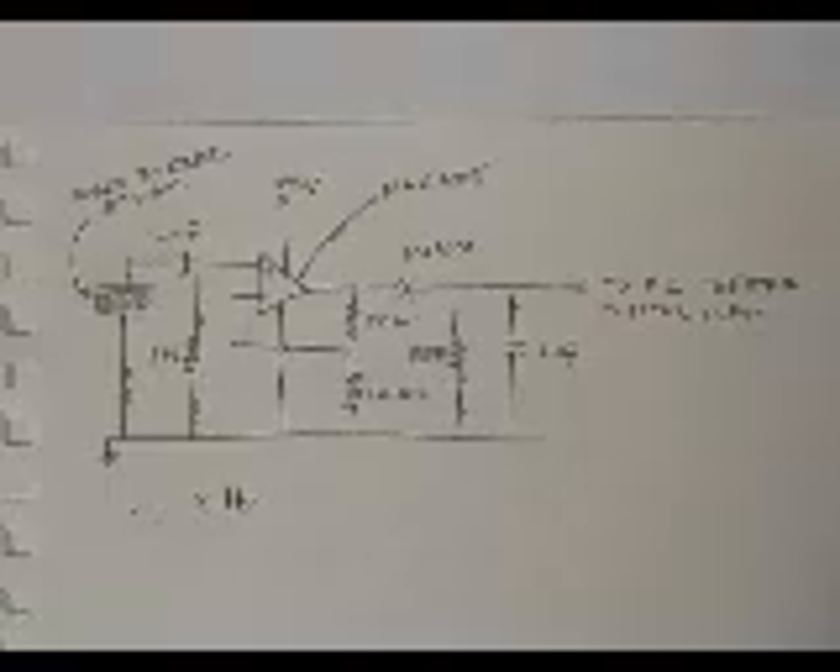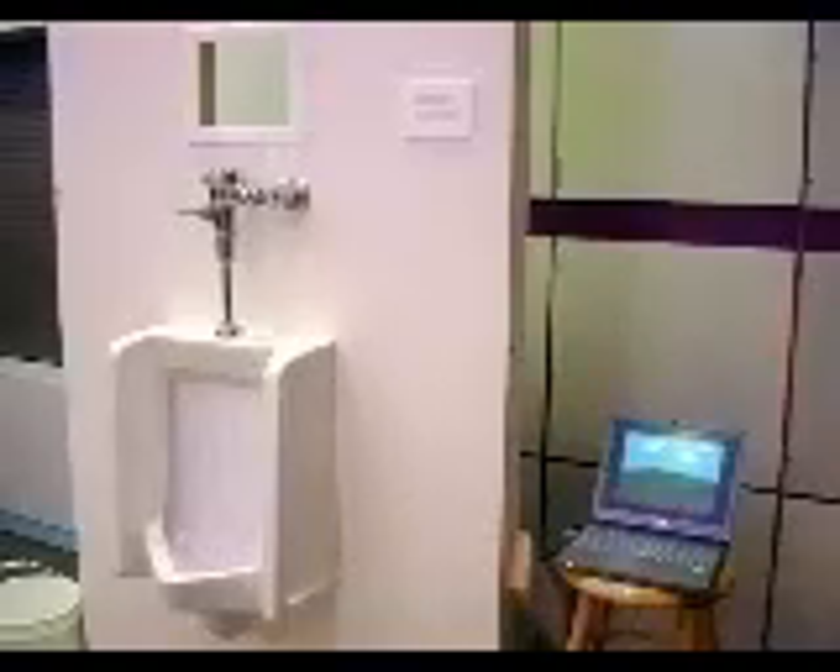The signal from each piezoelectric element is fed into a two-stage circuit consisting of an amplifier and an envelope follower. The signal is then read by a PIC microcontroller, which transmits the collected data to a computer over a serial link at a rate of 100 samples per second.